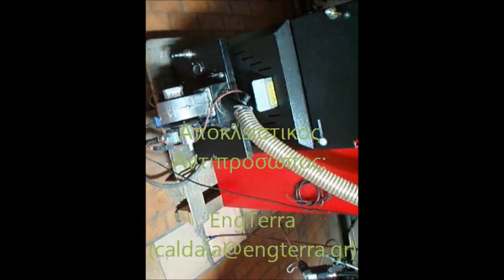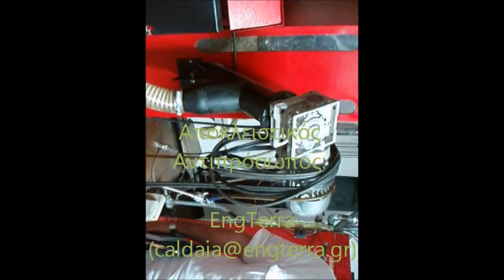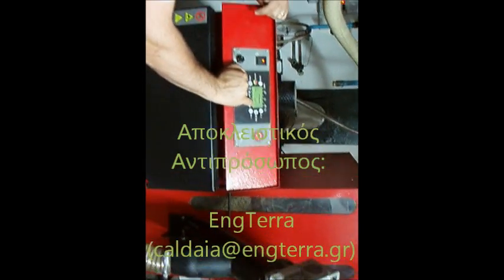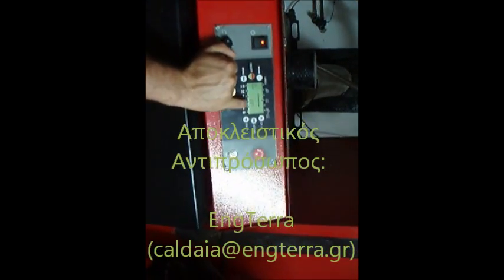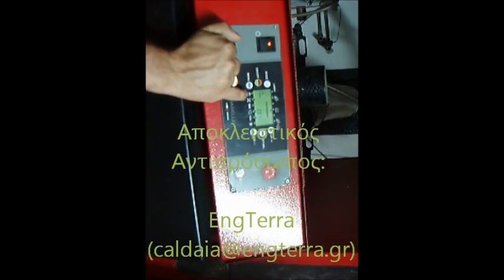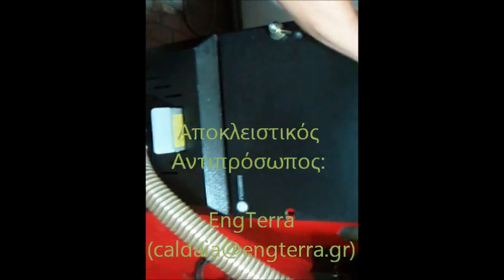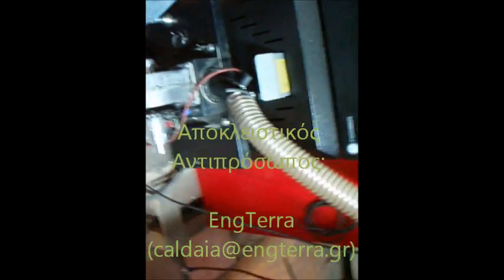Now it's slowly feeding in the pellet. You have the electric coil — it's on. You can see the black dock here. The fan is working, and this is the auger working. Now it stops — and this is the photocell, which is controlling the flame. It's not on right now because it can't see any flame at the moment. At the moment it sees the flame, it switches on.